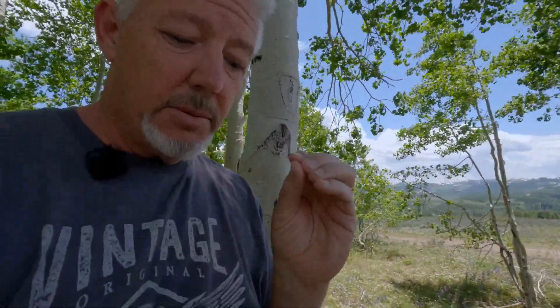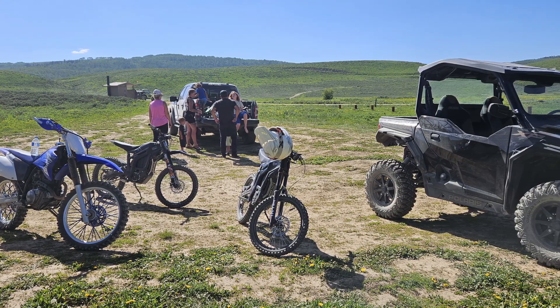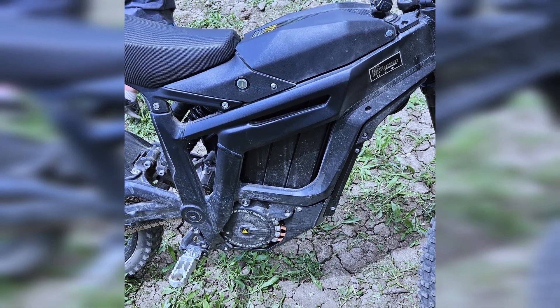One part of this test I didn't get to record: my son-in-law brought some e-bikes out. Charging the e-bikes was a 55 amp DC draw through the inverter — the bikes needed about 62 volts to charge. That was an incredible draw, and the system handled it perfectly.